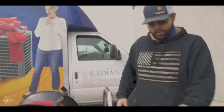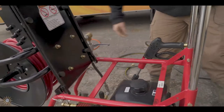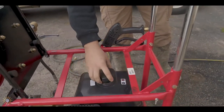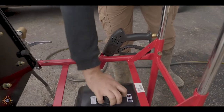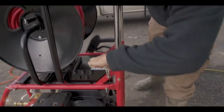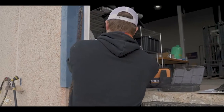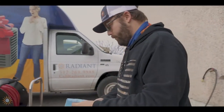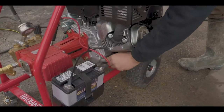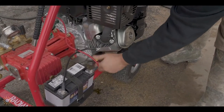Do a once-over making sure everything looks like it's supposed to be where it is. Check your gas - make sure you have gas. This little pin pops and you can flip it forward, and it stays there. Your gas cap is right here - pull it up, check inside. There's a filter, there's enough gas to run it. You can always top it off - be generous to the next technician. Make sure the cap is back on tight, fold it back up and secure it. Then grab a rag and go ahead and check your oil levels.